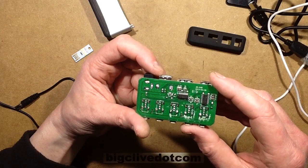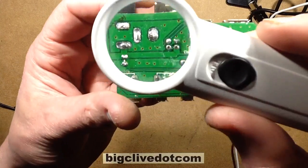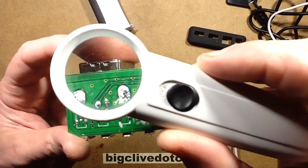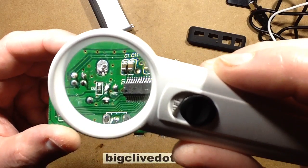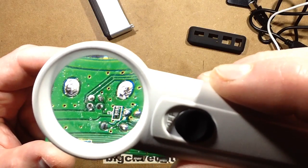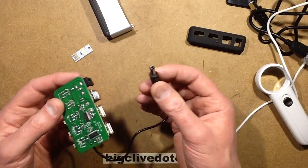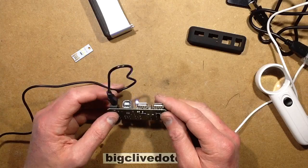So, here's the power coming in and the negative is going straight — there's the power coming in, and the negative is connected directly to the negative pin, the shell pin, of the host port. And the other side of the host port — the power is connected directly to the negative pin. So the negative has continuity all the way through. And if you look at the positive, it just runs — basically the power line is going straight to that port. There's no separation or anything like that; it really is just powering that port.